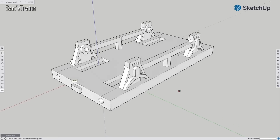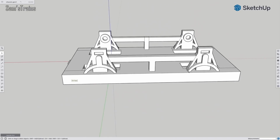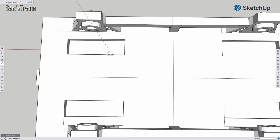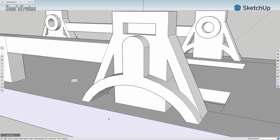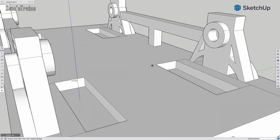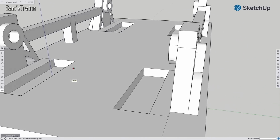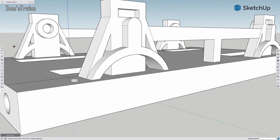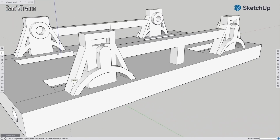So I went into SketchUp yet again and I produced this. Now I actually did this in quarters. So I literally created 1/4 of the chassis. I divided everything by 2 and I created one axle box and a little bit of detail that goes around it, just a bit of a spring or something. And then I duplicated that piece in software 3 times, flipped it and just connected it all together, and I had a full wagon chassis. And look at that. Overall, I'm quite pleased with the way this looks, to say it was thrown together in about 45 minutes or something like that.